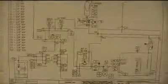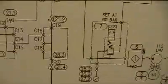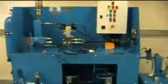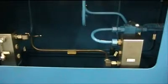We're in the hydraulic workshop in Tyne Metropolitan College and today we're going to have a look at manufacturing a piece of pipework to fit in between connections C14 and C16. If we look at the hydraulic test rig, we can locate the section of pipework that we want to produce between the manifolds shown. The pipework has 90 degree bends in, so we're going to look at the process of bending the hydraulic pipe into this shape.